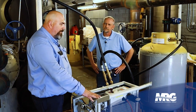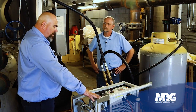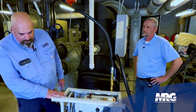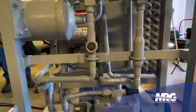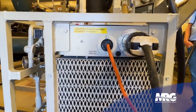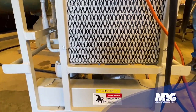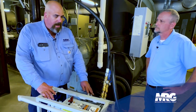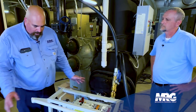Thanks Brian. This is a RevTech dual low pressure high pressure recovery unit. Today we'll be using it on a low pressure chiller recovering R123 refrigerant. Basically we have a vacuum compressor that we'll use to transfer the refrigerant. It also has an optional air-cooled condenser as well as a water-cooled condenser. The great thing about this machine is prior to even starting your recovery, we can evacuate a recovery cylinder and all our hoses to get all our non-condensibles out.